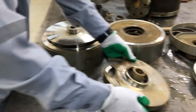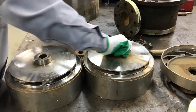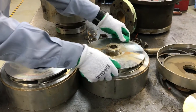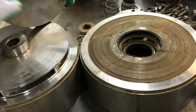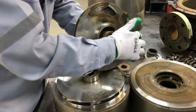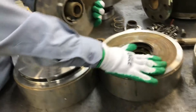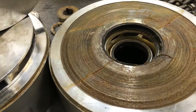The same way this impeller will also be fixed. Now you can see the plate — the rim has been damaged. That is the reason the impeller surface and the wear plate surface are touching easily. So we need to change the impeller, repair the casing impeller side plate, drain and change the wear plate, and replace the wear ring.